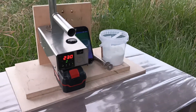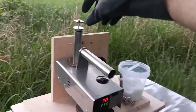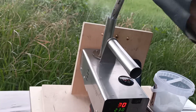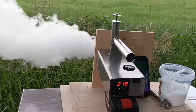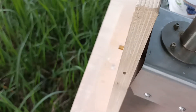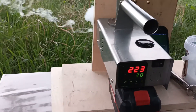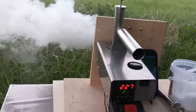I will put on the mask and then let's see. It is set up to two grams — let's press it. Okay, that's done, and it goes. It goes back to about 215 degrees and then it starts to rise back. You can see there is no depositing on the tube. It is hot enough so that it is fully vaporizing the full amount of oxalic acid. When it goes back to about 225 degrees you can pull out and it goes.